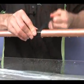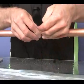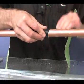We recommend keeping the tape stretched up to twice its natural length. We know every application is different; however, as a minimum guide, we recommend Crack'n Tape should cover 4-5cm either side of the repair. More may be required for more demanding applications.